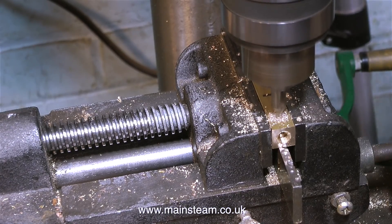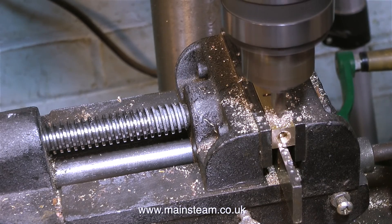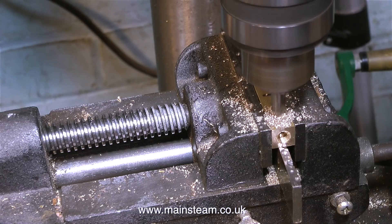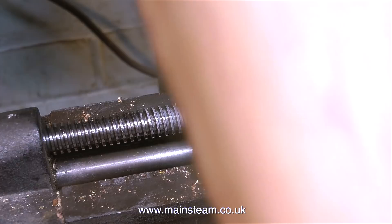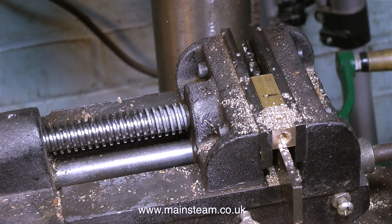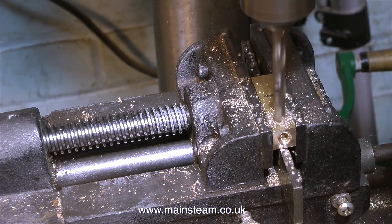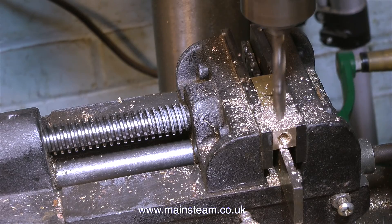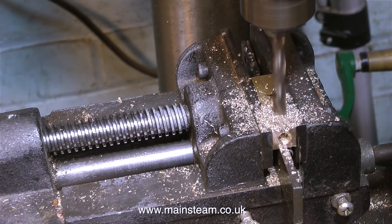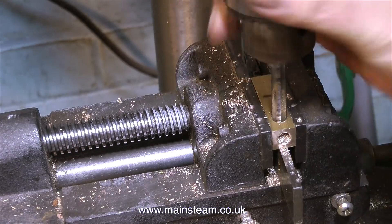At the moment I'm drilling the holes in the side of the brass bar, and I'm going to drill them a bit bigger and thread them 5/16ths by 32. I'm using a centre drill to start with to make sure the holes are precisely in the centre. How did I find the centre? With a ruler. I measure the distance, put a tiny mark on it, do a quick test, measure that the mark's in the right place, then push the centre drill through, followed by a twist drill, and then I thread the hole.